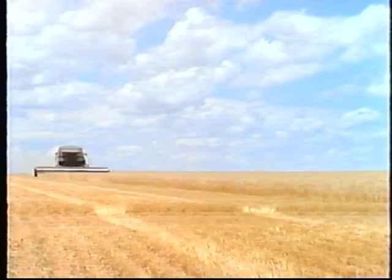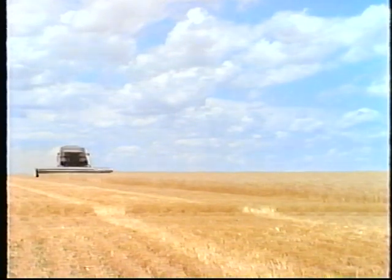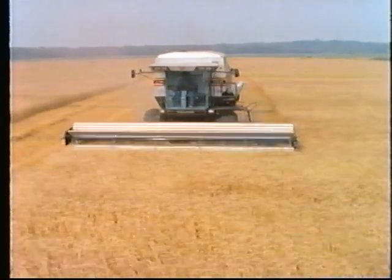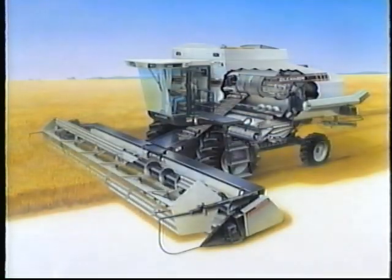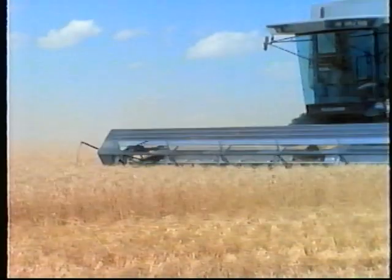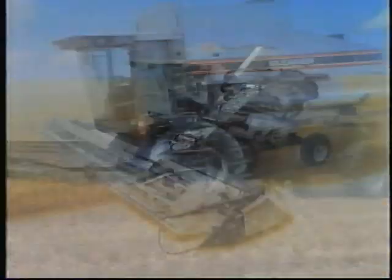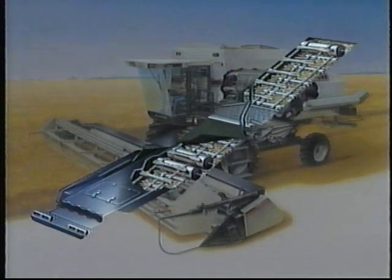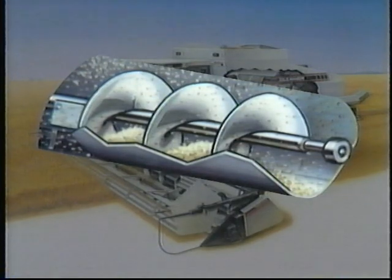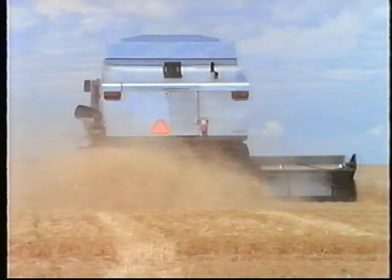Only the Gleaner Series 2 features a Natural Flow Harvesting System — a system designed to harvest your crop and clean your grain efficiently with minimal wear and tear. The harvesting system begins with threshing in the cylinder. The big difference between our cylinder and other rotaries is that ours is mounted side to side instead of front to back. This improves the threshing and reduces damage because the crop feeds straight into the cylinder instead of having to twist and turn before threshing begins. After threshing, the distribution auger evenly feeds grain and lighter chaff onto the accelerator rolls, while the heavier crop residue is emptied out the back.